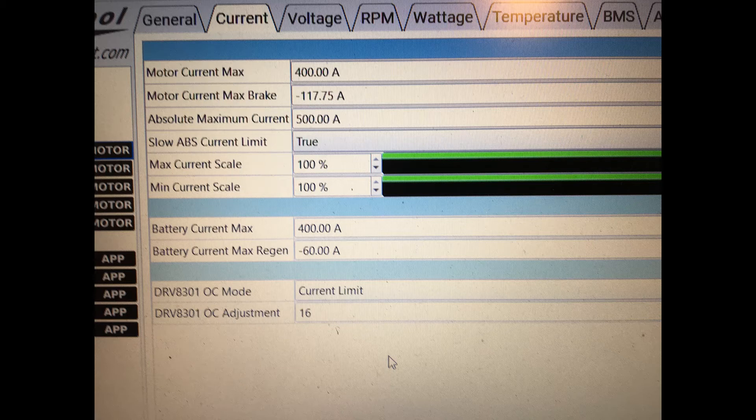I've run the field windings at 12 volts, just went full speed on the motor, and then increased the load, which is obviously that pressure flow valve. You just manually crank by hand, and then using the dyno setup — the weight scale going into the Arduino — it records the data.